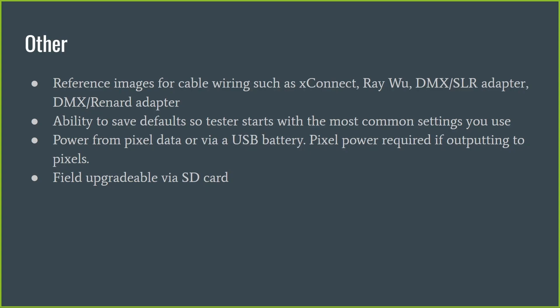There is a reference mode with a bunch of images that give you a pocket reference for how to create the crossover cables discussed, the X-Connect pin assignments, and which pins are positive and negative. It also has the ability to save defaults, so if you've standardized on certain types of controllers and remotes — DMX only or Light-O-Rama only — you can set all of those up, save those settings, and the device will always default to them on power-up, saving you from resetting it every time.